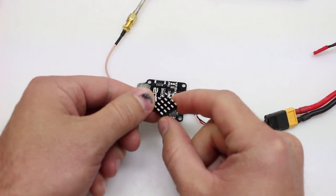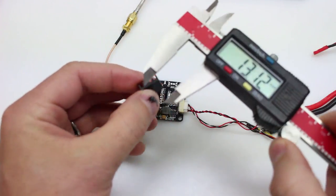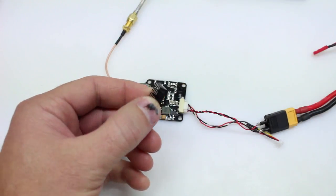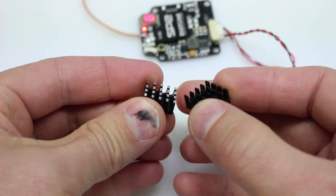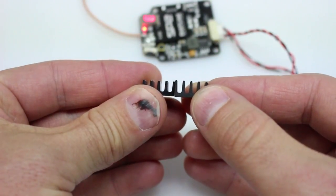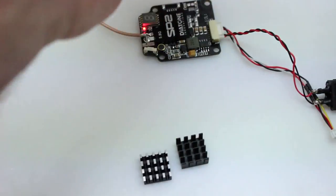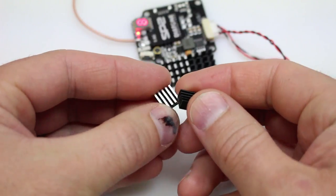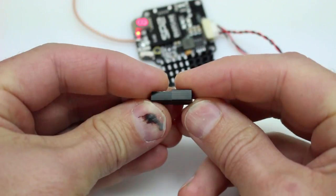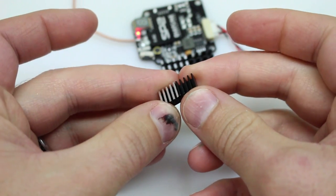The larger heat sink for the SP2 is measuring about 6.2mm tall. I did sand the top of this off just a little bit on a sanding block — a file also works. I brought it down a little, and I did the same thing to the smaller one too, which went down maybe about a millimeter. I think the full height was a little overkill.